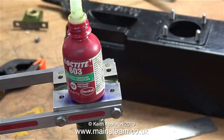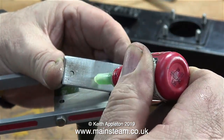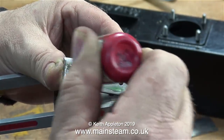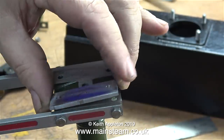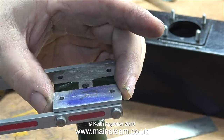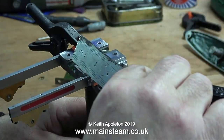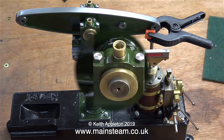I've drilled 5/32nd of an inch diameter holes in the steel plates as well. When these are fastened to the top of the column and I start the tapping process, they will hold the tap in perfect alignment into the holes as I cut the 2BA threads. If I just cut the 2BA threads and then drilled bigger holes in the steel plates, there could be problems should the 2BA tap wander. The next step is to stick the metal plates to the top of the column using Loctite 603, which allows me to carefully align the plates to perfection and hold them in position until the holes are threaded. Before the Loctite sets I'm making sure everything is where it's supposed to be — and thankfully it is. When I sit the bearings on top of the column they're exactly over the holes, so everything so far is quite good.